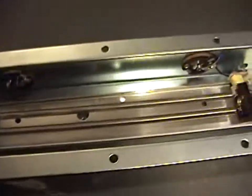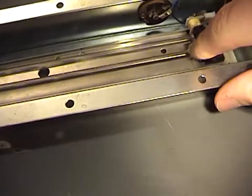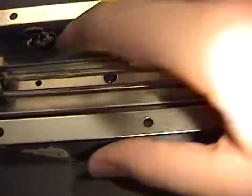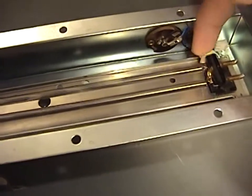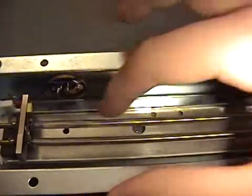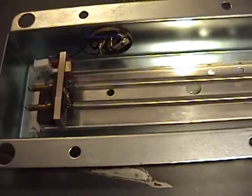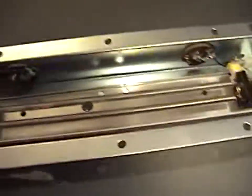And how the reverb works, of course, is because it's an electromechanical device, so because these springs move and because the springs are quite long, there's a certain resonance in the spring. So when an electromechanical representation of the sound goes through the springs, some of that sound reflects back and forth, and that's what causes your reverb. I'm not very good at explaining it, but that's basically how it works, and it works for sure.